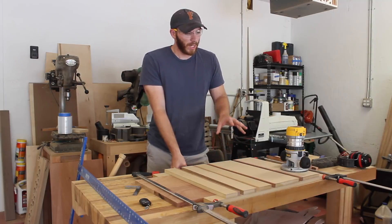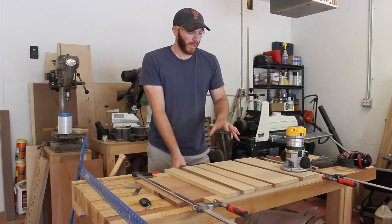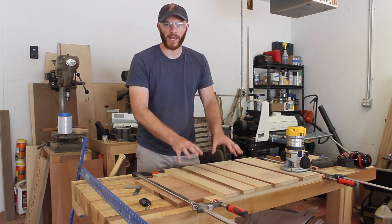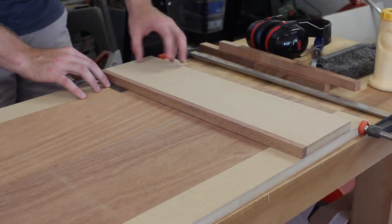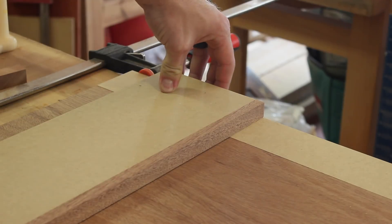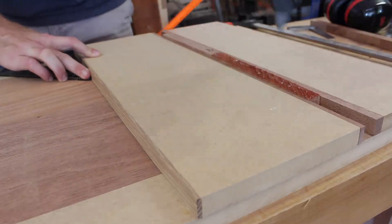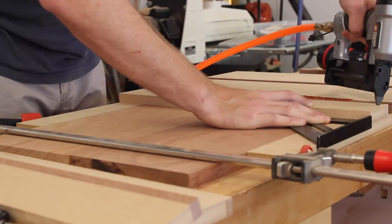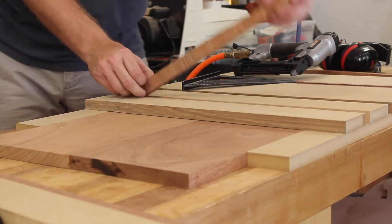If you saw my last apothecary cabinet build, you'll know that I had a couple of issues with the dados — some of them were not aligned properly, so that led to some of the dividers being out of square. So instead of using one jig that I slide from dado to dado, I'm going to build one jig for each panel that will have all the dados spaced properly ahead of time. I built a total of two jigs: one for the short sides and one for the long sides, which includes the dividers. I used some MDF with some hardwood edge banding to act as guides for the bearing on the bit, and I also had an off-cut from my material to mimic the thickness of my dividers. It was really important to get the first piece nice and square because the rest of them will reference off of those. The top three rows will be three-inch tall drawers, so the spacers are trimmed to three inches wide, which corresponds to the spacing between the dados. The bottom two rows will be seven inches and eight and a quarter inches, and they'll have corresponding spacers as well.